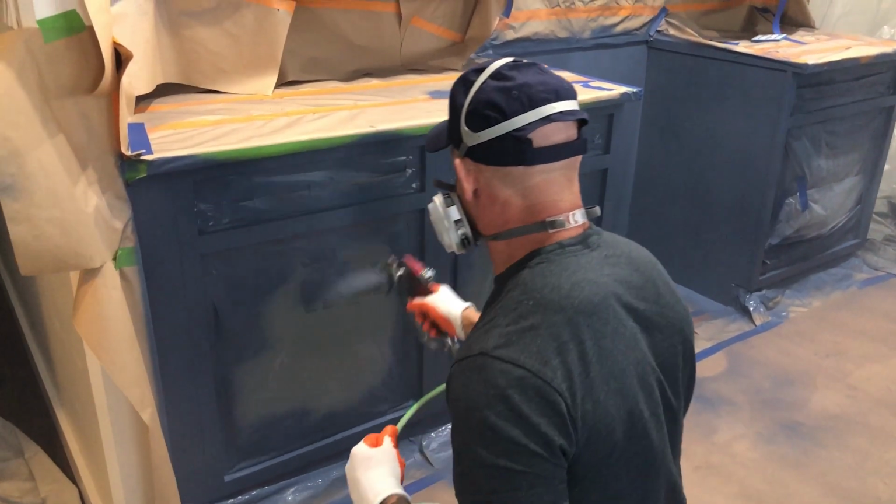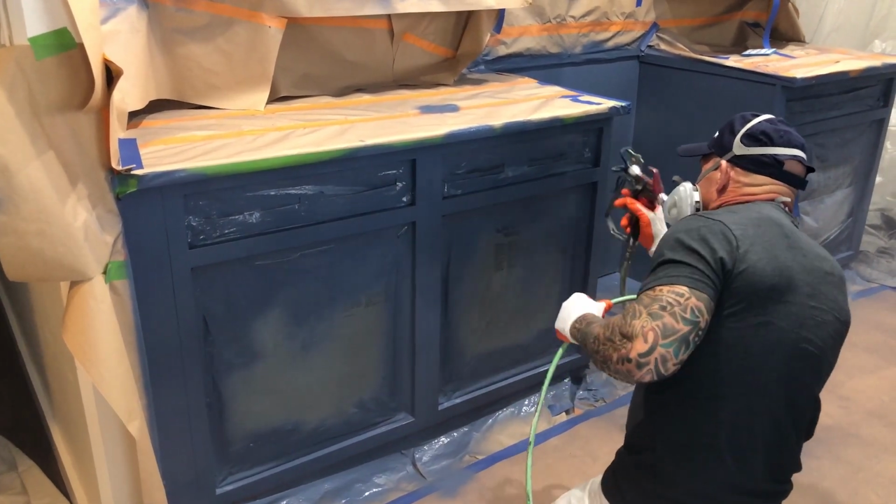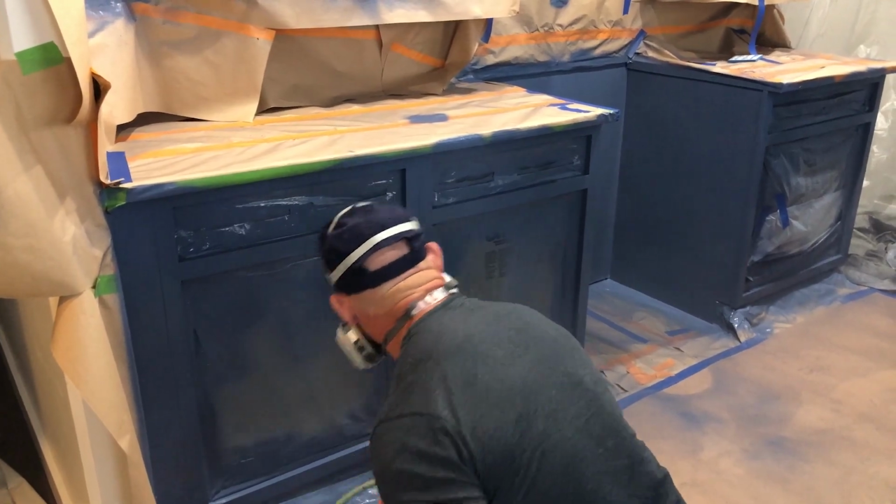But if you don't catalyze your final coat, then you're not going to be getting that chip resistance on the top coat. You're not going to be getting the chemical resistance. You're not going to be getting that moisture resistance on that top coat. So it really is important to catalyze each coat. I know you are limited by a pot life, and then when that pot life expires, that product's not any good anymore. But if you do proper planning, it's typically going to work out for you. You're going to be able to get all your coats in and get them done same day.